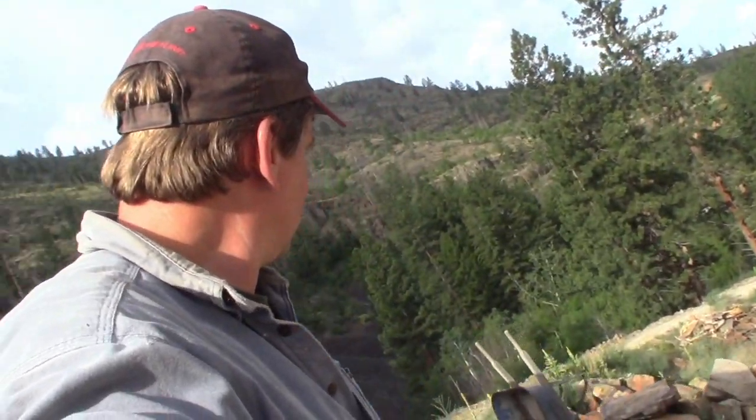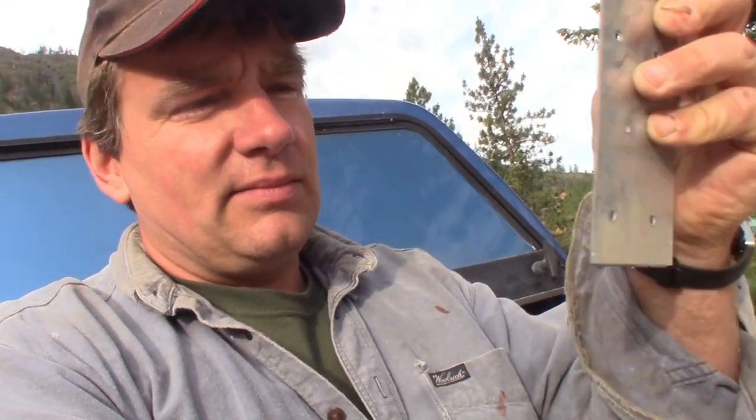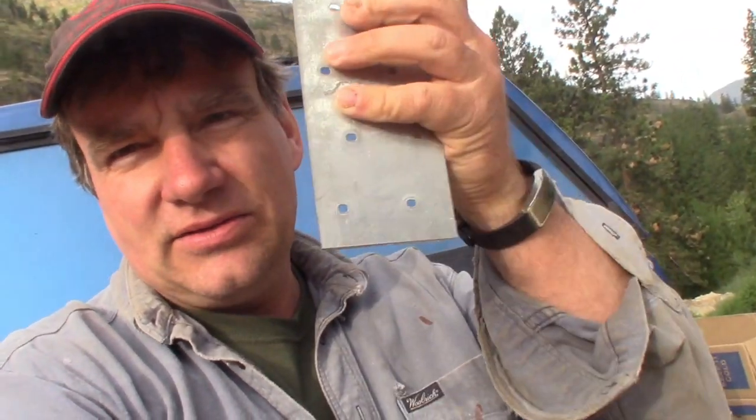Today we hope to un-hump those floor joists that are a half inch off, get them straightened back out and put back down. I'm going to put in some Simpson Strong Ties right at the j-bolts on the foundation, and then they'll go up and grab the rim joists. It's not something that needs to be done here in the canyons of western Montana, but I was given a roll of it — thanks Steve — so why not do it.